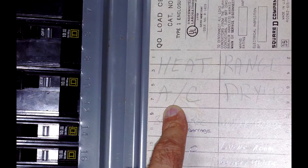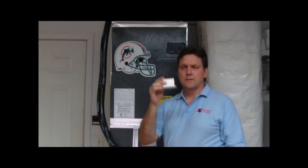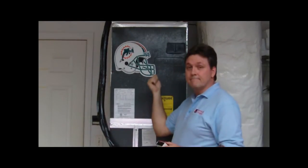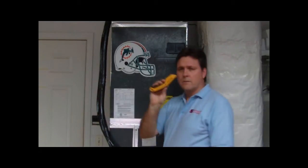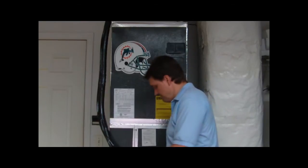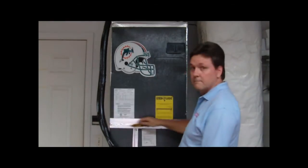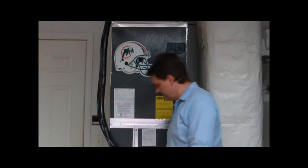This is what it looks like. First thing I will be doing is turning power off at my breaker panel. Make sure you turn the indoor and the outdoor unit off. I'm at a customer's right now and I'm installing this Ion Generator inside his unit. He has the metal tape and has it all sealed up so it doesn't pull anything from the garage. I'll be using an X-Acto knife and a nut driver to get inside his unit — cut the metal tape, then use the nut driver and pull the panel right off and go inside.